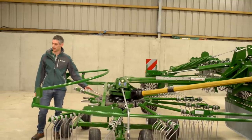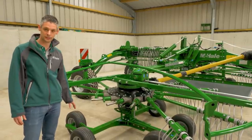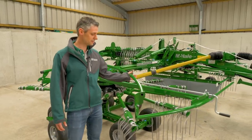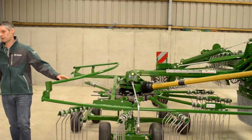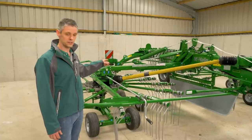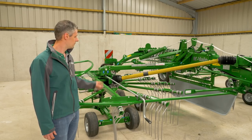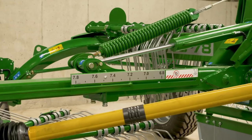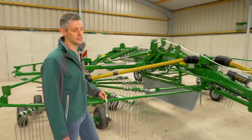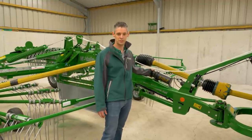The machine features a heavy-duty maintenance-free cam track with independent suspension on each bogey and steering on the front. Safety guards can be folded out into position when working in the field. The rotor width indicator can be seen from inside the cab and adjusted from the cab as well. Make sure you don't engage the PTO when the indicator is in the red on the decal. Each machine has the flask with the operator's manual and spare parts manual for reference.